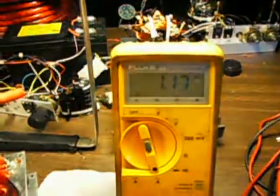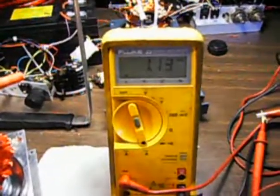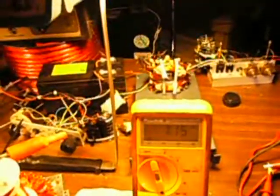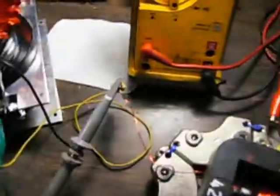And there's our voltage, boys and girls. On that. As you can see, let me just make sure. We're on 10 times there. Okay. And with the meter in line, we're now showing a slightly different amperage reading, or the meter connected to the circuit. There's no ground connected there, but we are getting ground right there from the other scope probe.